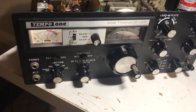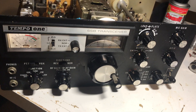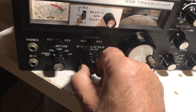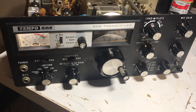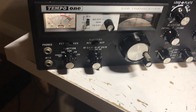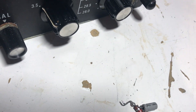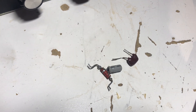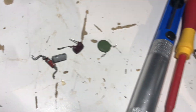I turned it on and went back to my IT work and could hear people faintly — the radio receives. But I couldn't hear much at all. I spent time debugging the circuit and it turns out this little ANL on/off switch didn't work at all, and all the audio goes through that switch. If I had just fixed that, the radio would probably be working great. But instead I said the audio is bad, and I found that somebody had put a bunch of modifications on this radio — parts soldered onto the IF board near the volume control.